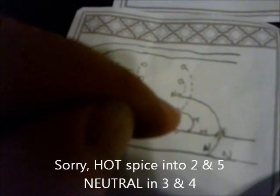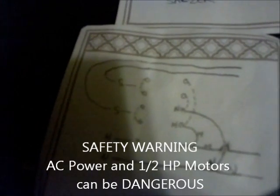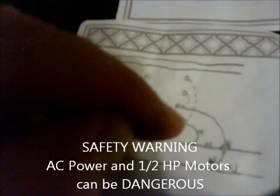So on the other side of that hot, that's going to be your primary winding, and that's going to be your primary neutral, and you're going to have to splice these wires or make sets, and then you'll wire the hot into this one, which effectively puts it in first and fifth, and the neutral into second and third, and then you just have the 2 starter wires come out depending on the direction you want over here. And these 2 are tied together, so you tie it to either one of those, not a big deal. And so that's just a crazy way to get 2 wires in and 2 wires out and get them to cross and switch. You effectively need 8 poles and 2 switches with a bunch of crap in between. So that's the way I figured out to do it. I think that's the best way to do it. I really couldn't figure another way to do it, and there's no solution online. So go about wiring that, and I'll show you the finished product next.